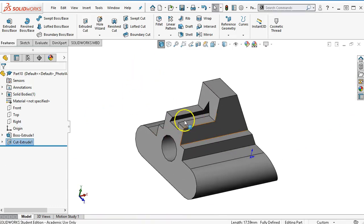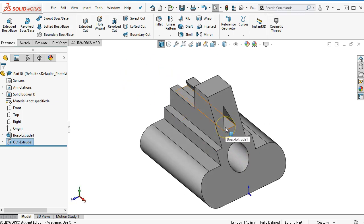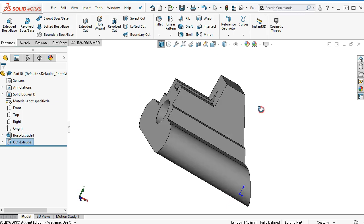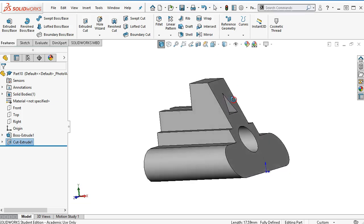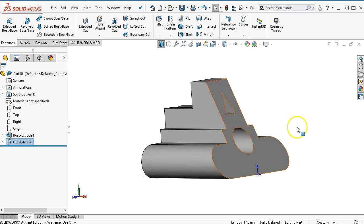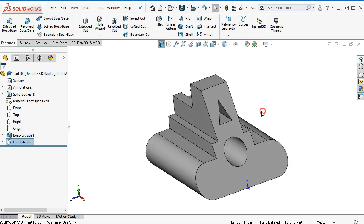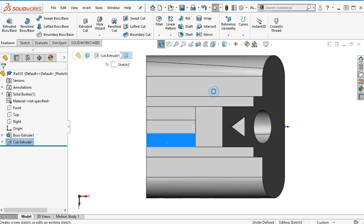Since we don't really have a terminating feature and it's not shown, I'll give you the option of what to do with this geometry. Because I included it in the original sketch, that's a little bit of an issue — I don't know where it stops. Maybe it stops at this face, maybe it only goes a little ways in, but without a depth we have to make a decision. My tendency on the manufacturing side is, since we're going to have to EDM this shape, preferably I'd be able to drill a hole through and put it on a wire EDM and go around the profile, as opposed to having to make an electrode and burn out the shape. Manufacturing process — thinking through to that next level.